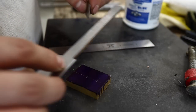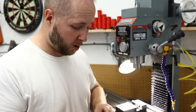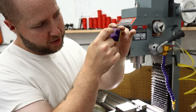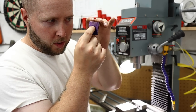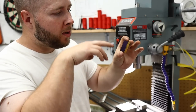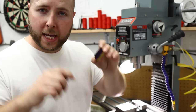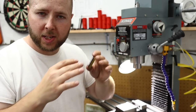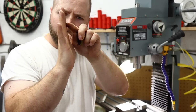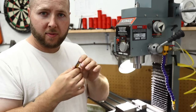Now this cut right here is exactly the reason I got this mill, or the primary reason, the making of guards. This would have been pretty complex before. We have to do an eighth-inch wide groove cut through here that a tang can slip through. And before, that would have been a bunch of 1/8-inch holes. And of course, your bit tries to draw into the next one. So you can only get them so close together. And getting them in a perfect line and not wavering, which gets you outside your eighth, is very difficult.